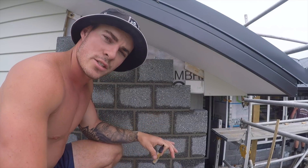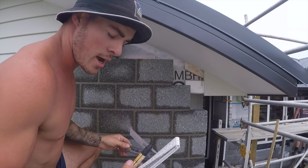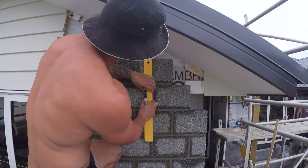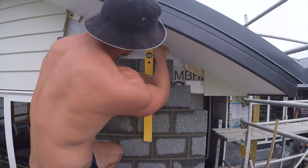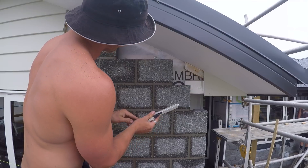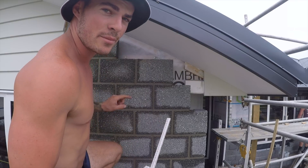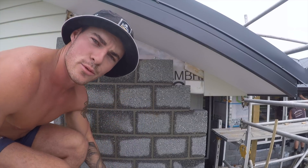So now we're up to our angle cuts. There's two ways you can go about doing it — either with your ruler or a bevel. I'll show you both ways. So I'm wanting to work out this cut here. It'll be in line with this brick here, so I'm going to plumb up from the edge of the brick. Mark where that is. Now measure up from that point — I've got 105mm. And we want a 10mm mortar bed, so I'm going to mark on the edge of the brick 95mm, so we have a 10mm mortar joint underneath it.